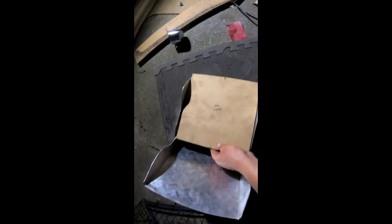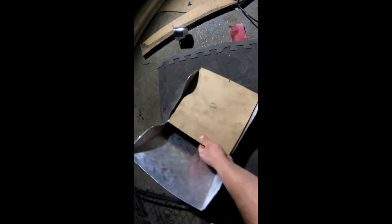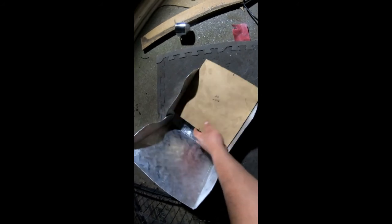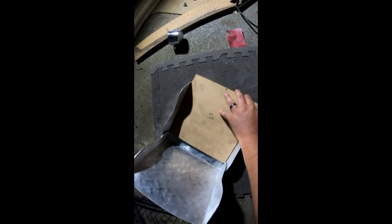So that's what this piece will be. That's the one thing I did realize. I have to trim off about a quarter inch off of each one of these pieces of wood, since, like I said, this is 1/8 of an inch thick. I did not realize I didn't compensate for that distance, so that's 1/4 of an inch on the inside to inside. And obviously, since it curves in a little bit, see how they don't sit all the way?